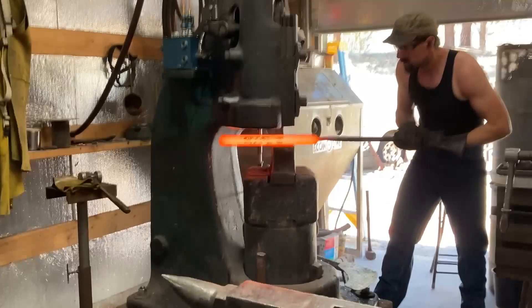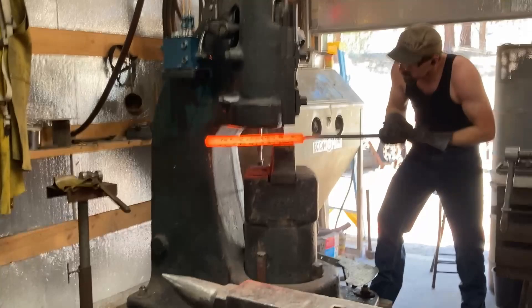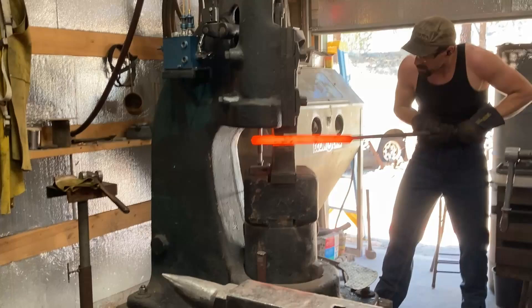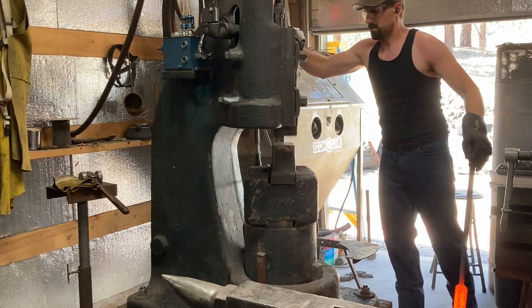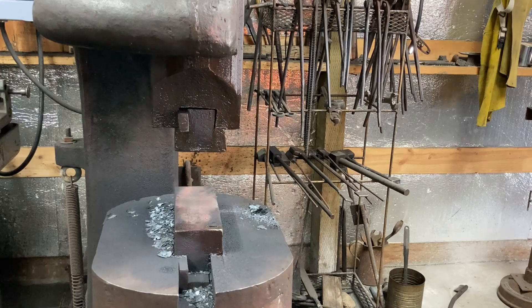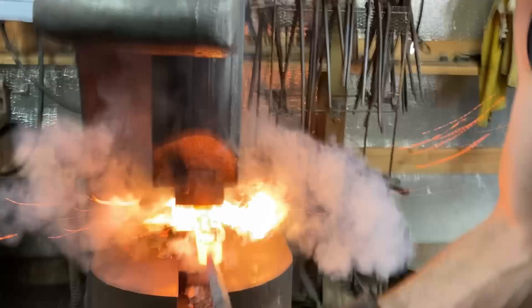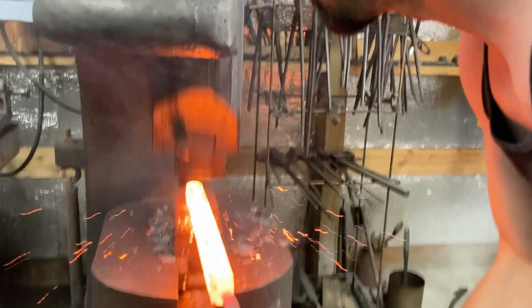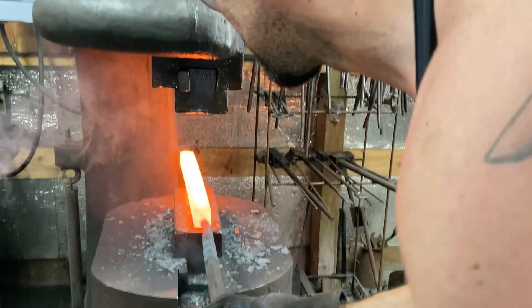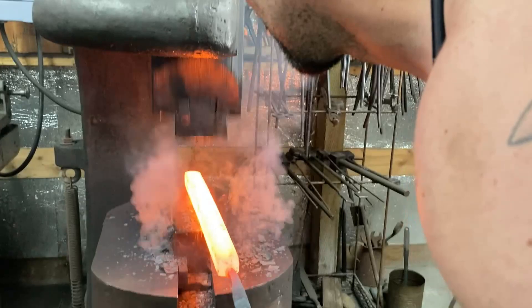I think this is a ton of fun to do. I'm very happy about that hammer — I always wanted it to be a drawing machine and a general-purpose shape-forging machine, and it's already doing the former and on its way to being controllable enough for the latter. Here's a slightly different angle to give my perspective when I'm really trying to square something up lengthways on the dies in the Beaudry. I'm just going to finish squaring and flattening it for the next re-square now that I've drawn out the length I needed to cut into four pieces on the Niles-Bement hammer.